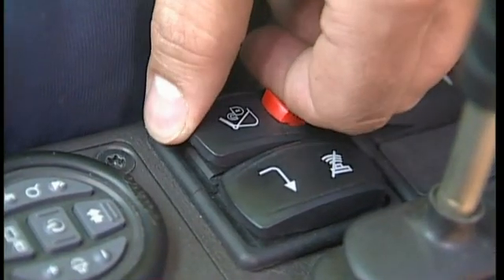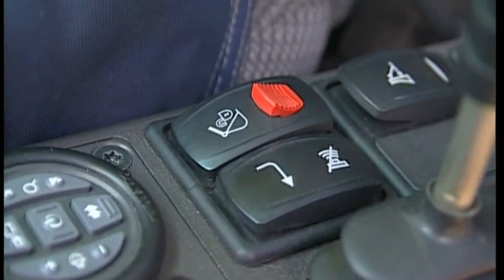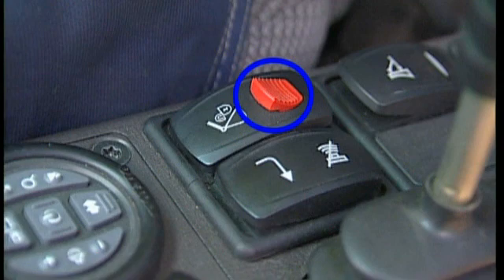Press the safety switch in the cab to operate the hydraulic cylinder. This pulls out the locking wedge in the attachment hook. As it is a safety switch, you must first press the red knob on top of the QuickFit switch to be able to press the main switch down.